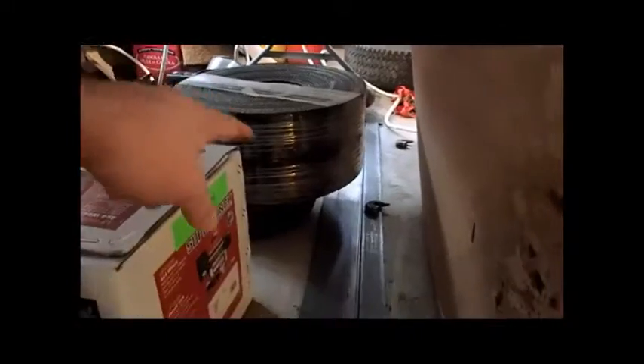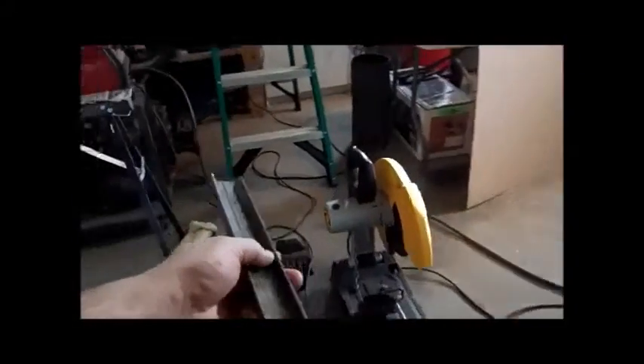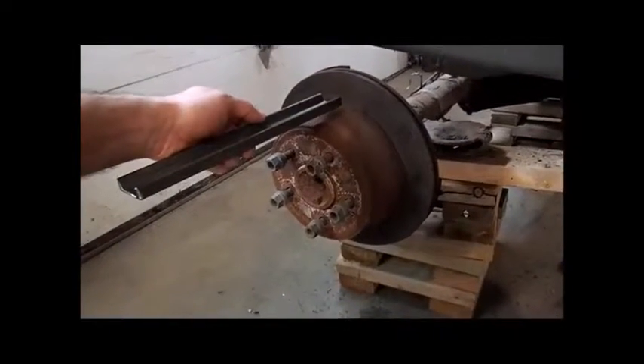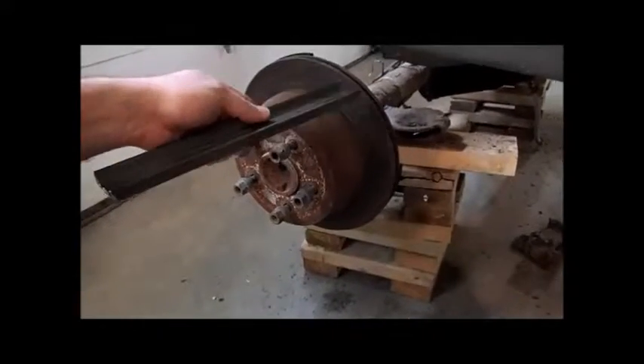The track material is in two pieces. When bolted together — my kids have cut all of the cleat pieces. This is a shallow channel or instrument channel, and as you can see it's got a small flange to it. This will go between the two pieces, and the cleats will go in between the channels — one channel here, another channel there, with rubber strips in between. With an 8.5 inch diameter, as the cleats roll over with the track, it'll just clear the edge of the body. I don't really care if it hits it a little bit, but obviously we don't want to completely wreck it.